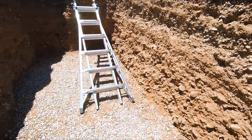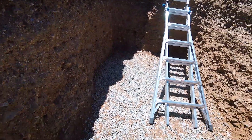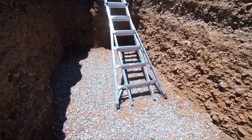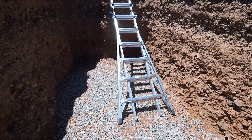This is what the finished bottom of the tank excavation looks like. It's already got gravel in there, but I just added a little extra crushed granite. We've got it leveled and compacted, so now it's ready for a tank.